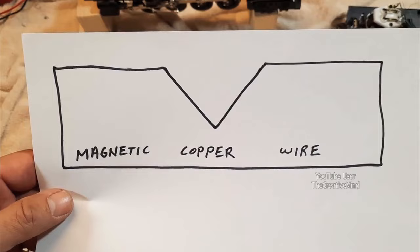It's only through AC electricity that we have these positive and negative pulses in the wave that help with this energy transfer. You will not get that with DC. With DC, however, you will have a pulse when the power supply first starts off and then it will regulate out — to 5, 10, 15, 24 volts, 48 volts, or even for my megger 1000 volts. So when I used my megger on the double field coil — with the clips on the red and green fields — I sent out that 1000-volt DC pulse and the megger picked up on its own magnetic field, thinking there was a short, and sent the LEDs to the top of the meter.